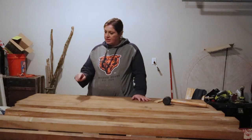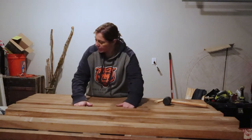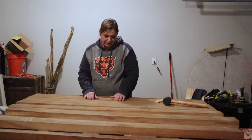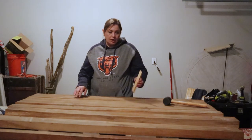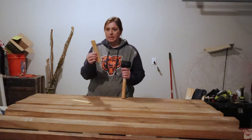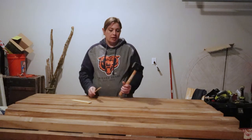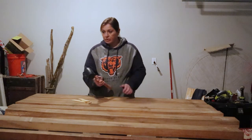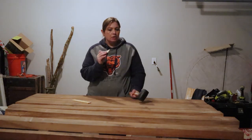We have our tabletop and it's actually already come apart — that's why we're really gluing it together. But some of the pieces decided that they aren't ready to split yet. So what I'm going to do is help along the ones that are already splitting by using a shim and a persuader. A shim is just a scrap piece of wood with a taper to it that allows you to kind of get it in. And this is a rubber mallet — I don't want to use an actual hammer because it could dent the wood or split it altogether. It's too heavy. This is kind of just a persuasion technique.